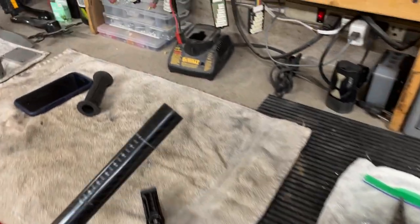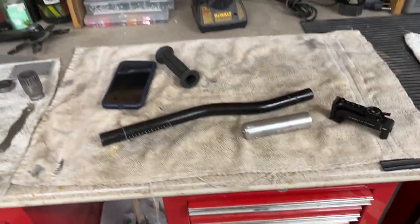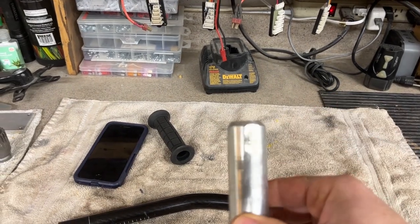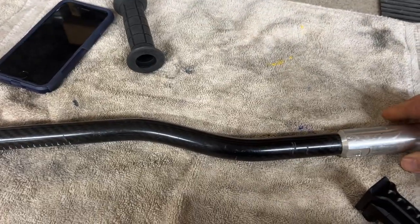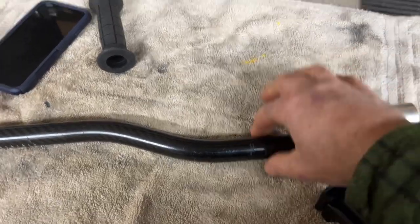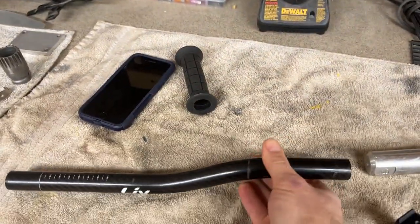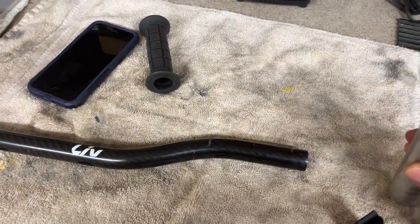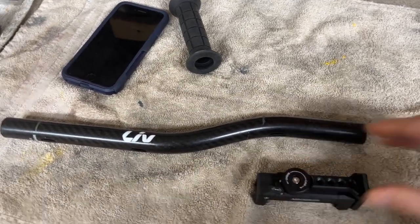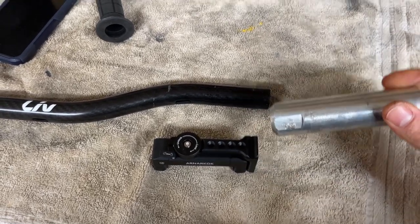And let's see if I can find some aluminum to use to make that part. All right, digging through my bin of extra material, I found this piece of aluminum that I can use. We'll turn that down. We'll put a little step on it so it'll capture the end here, right to there, and measure the inside diameter, and it should just slip in there. We will tap for a 1/4. Cut a little 1/4 stud. And that just screw into there, and that should do it. Let's go put this in the lathe.